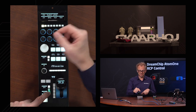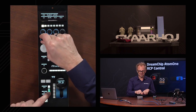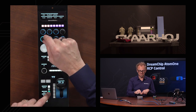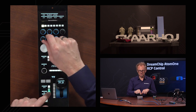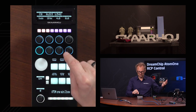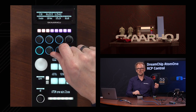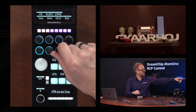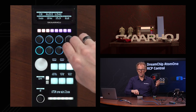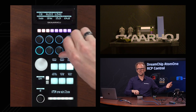DreamChip cameras have 24 of these by default. You can go to 12 if you want only 12 choices with this rotary encoder, or you can go to 32 and have seriously 32 dimensions you can adjust with saturation and hue. Let's go to 24 and then go to the red vector — we have a red car and a red color chart with a red tile on it. If I change the saturation heavily, you see the little red tile on the color chart is more red and the car is more red. If I turn it the other way, you basically see how it's made green, and if I then change the hue, you can see I can change the color of the car to green, or even make it blue going in the other direction.